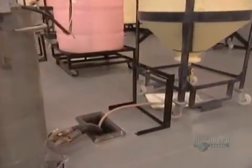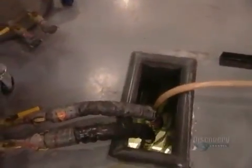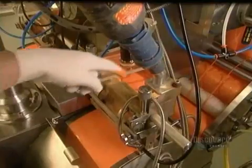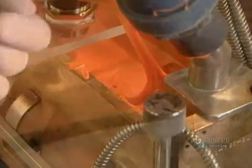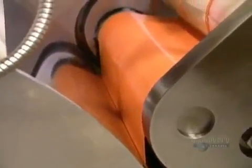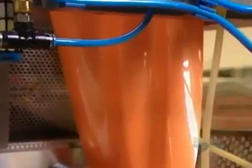The gel and fill meet their maker in what's known as the feed room. Here, the vats of gel and fill feed a capsulation machine one floor below. This machine is the same kind used to make bath beads and gel cap medicine. First, the machine spreads out the gel onto a cool drum. This creates a continuous thin sheet of gel called a gel ribbon. This cooling cures the gelatin to the point where it can now be molded into the hollow shell of the ball.